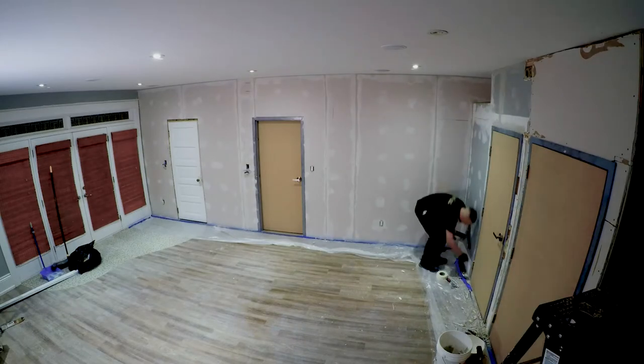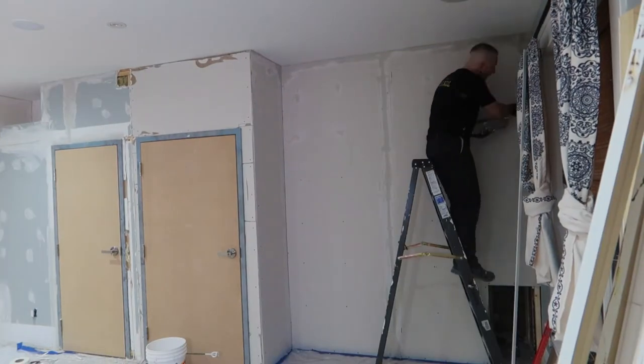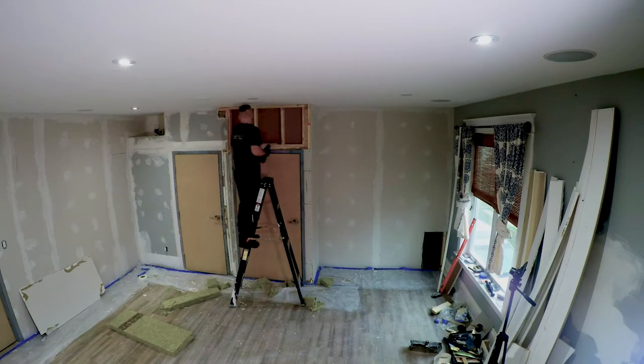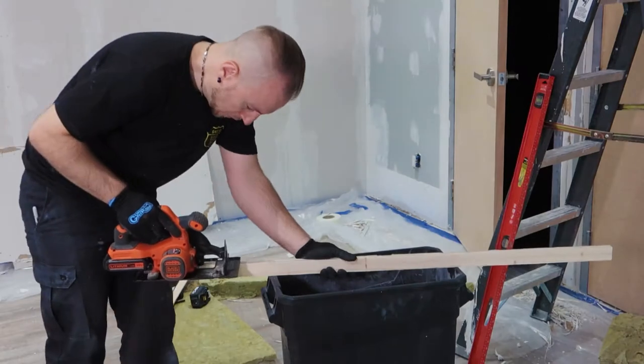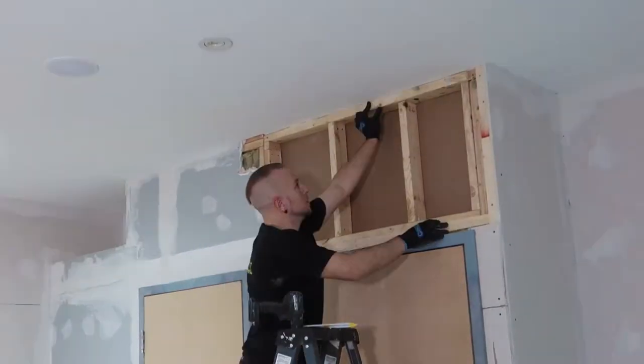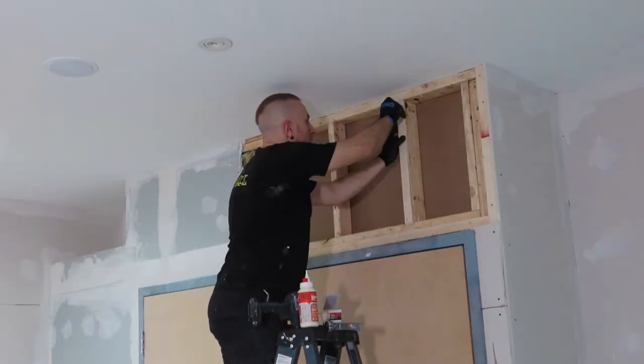Alright, so here I actually realized that I didn't do the best of jobs below this sheet of drywall. You remember those drywall screws supposed to be 16 inches apart? You need to have a wooden frame every 16 inches as well, and I actually did not do that until now. I also had an issue with a bit of a taper in that frame because I haven't framed before, so I think I installed it not square.